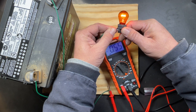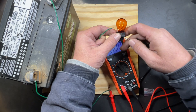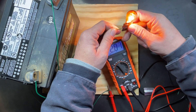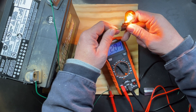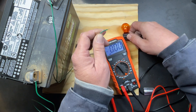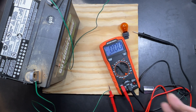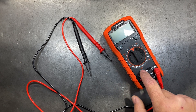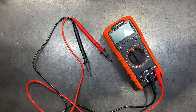We're getting 0.55 amps. Switching to the other filament — the brighter light — we get an amp draw ranging from 2.02 to 2.04 amps. This confirms it was a good idea to start on the 10-amp side, because otherwise we would have blown the smaller fuse. And those are the basics of using a multimeter to troubleshoot electrical problems — both AC and DC voltages, amperage, and resistance and continuity. Thanks for watching and I'll see you in the next one.